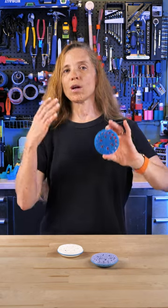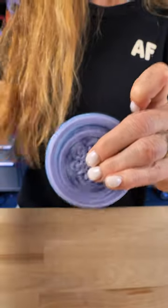I love this because it's a great way to sort of test your 3D printers. You need to print it with a 0.4 millimeter nozzle at 0.2 millimeter layer heights. I printed it in PLA, I printed it in PETG, and I printed it in hyper PLA. When you're done it's not going to work immediately, but if you break it up and move it around a little bit it absolutely will.